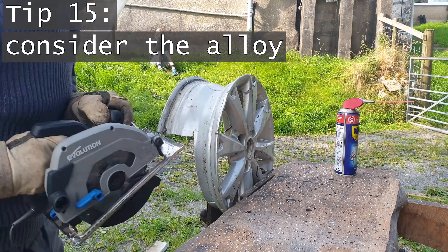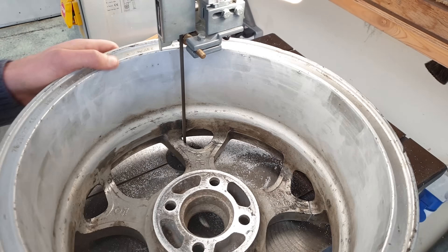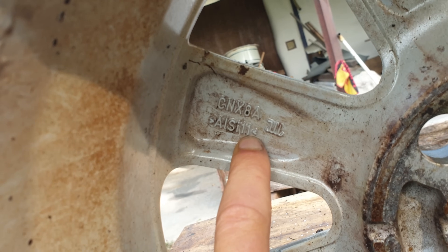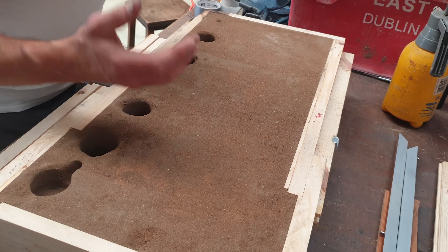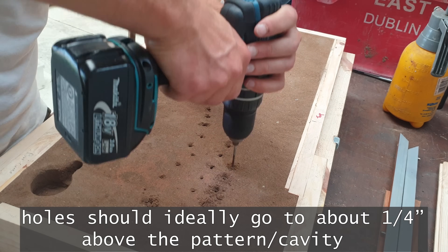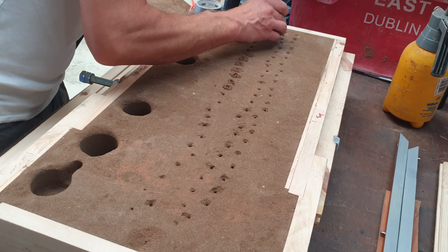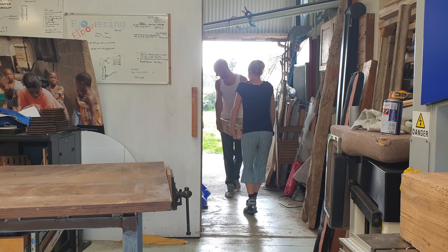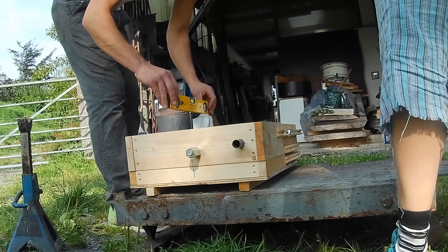Tip 15: The alloy you use makes a huge difference. I've written a whole blog post on this, but just to say old alloy wheels are my favourite - they often have their particular alloy printed on them, such as AlSi11. It's been overnight and I'm realising I need to put vent holes in. It's much better to put them in when the pattern's still in the sand, but I forgot to do that. It's usual to jab holes in with an old bicycle spoke, but without the pattern in I'm afraid it'll cause cave-ins, so I'm using an old drill bit instead. Notice the wooden battens we're placing this on and the air gap below them - that's for venting too.